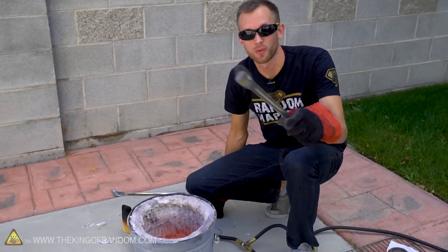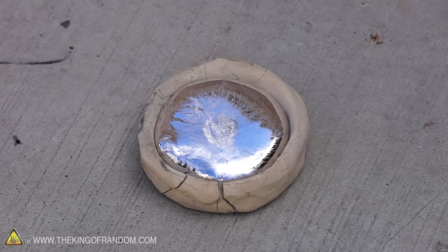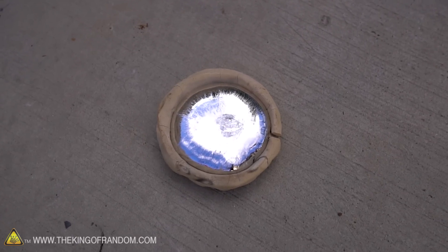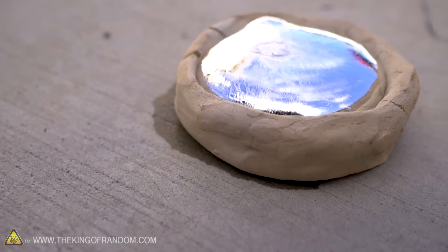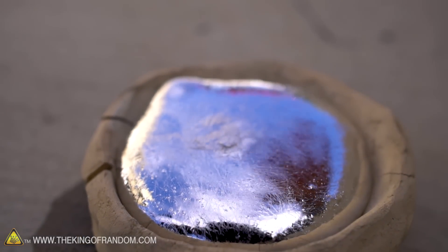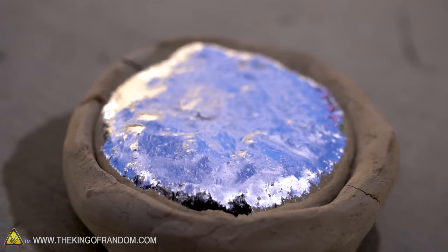Our aluminum is nice and hot, and first we're going to try pouring it into the fired clay. I hear a lot of crackling noises going on from that clay now that I've poured in the aluminum. There were already a few little cracks in the clay, and I think I see a few more — they may have started to expand. The heat from the metal is going to make the clay expand. There is a little bit of water gathering around the bottom — I don't know if that's water that was somehow in the fired clay, or if it's water that was in the cement pad beneath it, or both. That's a really cool, shiny look — I love the reflection of the sky and clouds in that. There are lots of tiny little points appearing on the surface of the aluminum, almost like bubbles rising up. The dome on top is no longer quite as smooth, and I think that's because the cooling metal is starting to contract.